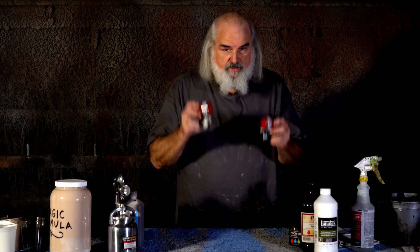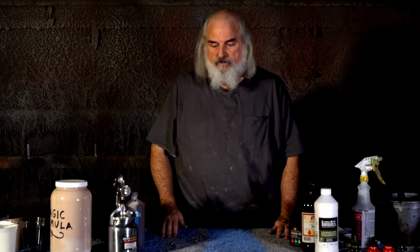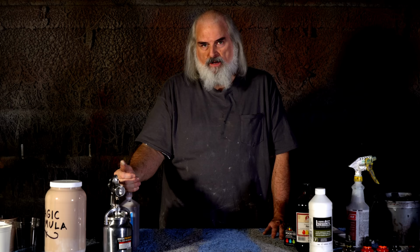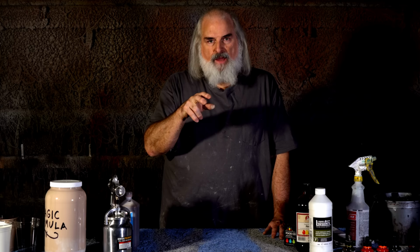But that is how we mix the rub out. Now, these same inks we use for detailing and eye colors and things, and we thin all of them. We'll thin them half and half. So if we're gonna do a black and we're gonna run it through an air gun, it'll be half isopropyl alcohol, 70%, or corn alcohol, and then half the ink, and it flows nicely and comes out of the airbrush great.